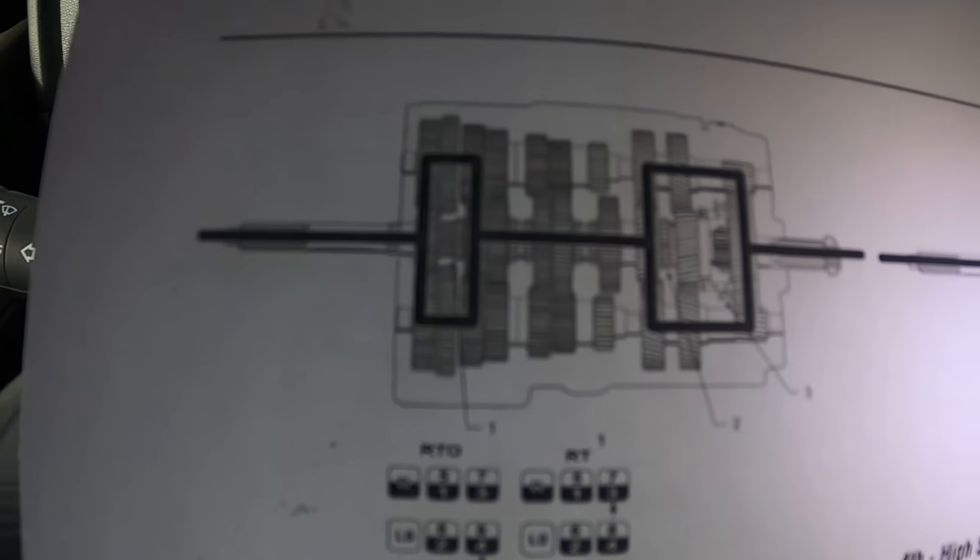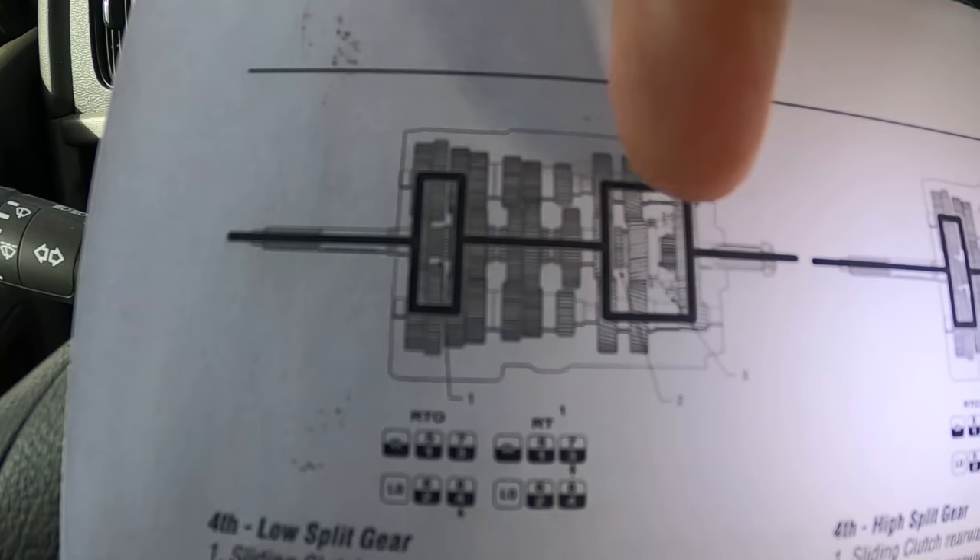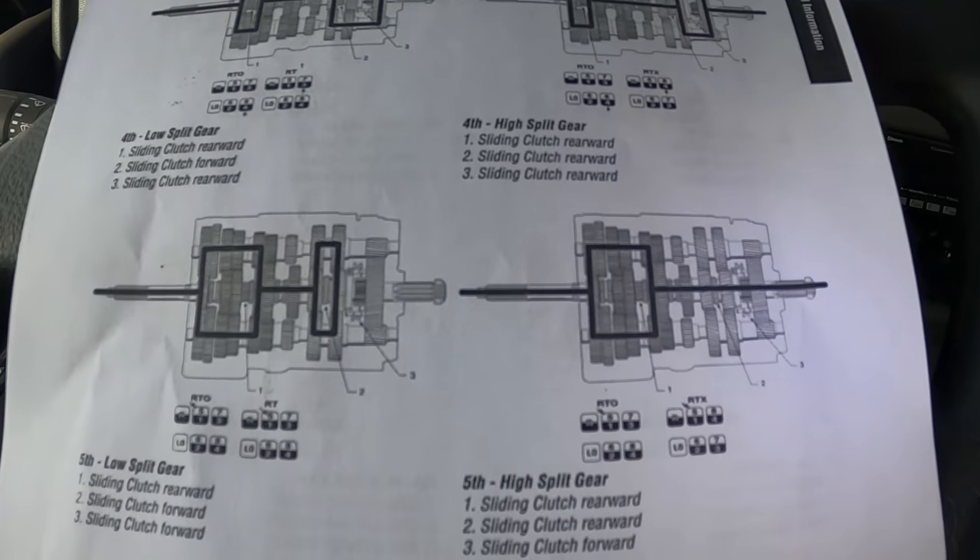Because that's the gear we want to avoid — and that's the one right there. You can see it goes through just behind it, then gear reduces in and out the back end. Whereas if you have your splitter forward, it goes in and through the weakest link gear and out. So think of it this way: splitter forward equals front box, splitter back equals back section. Just think forward to keep it in the front, and it's the toughest it can be.